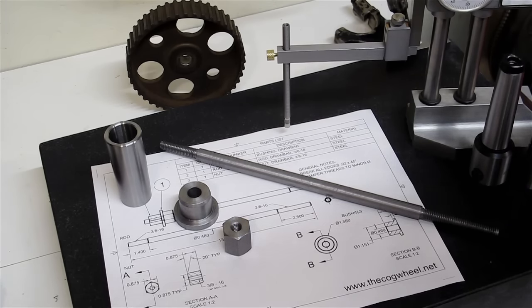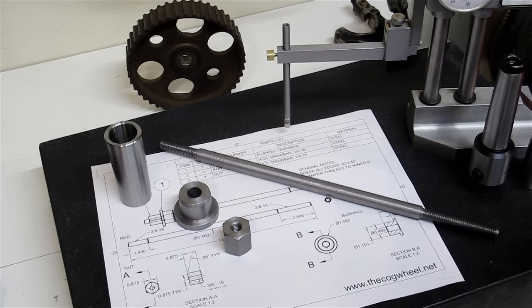I think it was due to the drawing process. It had a very tough, hard layer, so it took some work to get under it. I still have the burns all on my arms. The chips were coming off blue. Okay, so now I get completely why the Brits put the carriage wheel on the right side of the lathe.